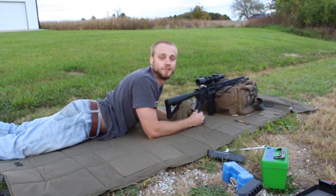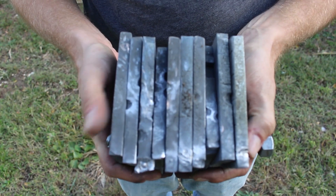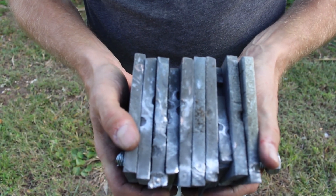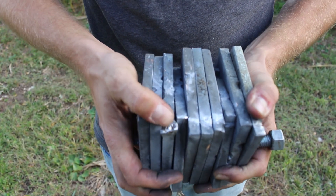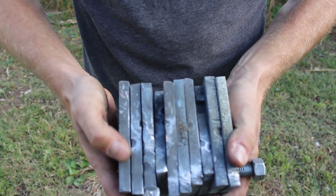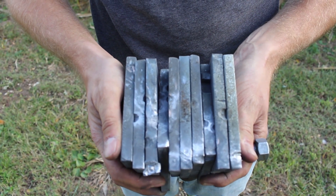That's 30 rounds. Our contraption held up. Here are the results before we take the plates off — they're in a randomized order. I can tell these are the laser cut; you can see how the metal not only really got dinged up, but it's cracking and splitting. I surmise the ones that have just the dings on them are water jet cut, but we'll take this apart and take a closer look.